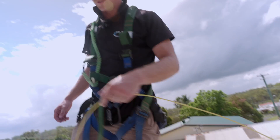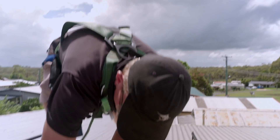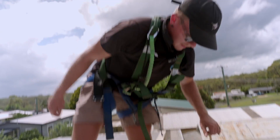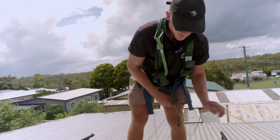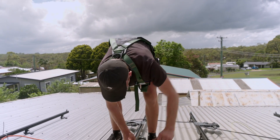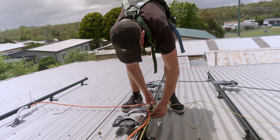Just make sure to get the earthing done before we start doing our terminations, because it's something that's essential to go into each and every terminal. Leave it until last once everything's tied, then come through and let it have its own clear little pathway, making easier and shorter runs.